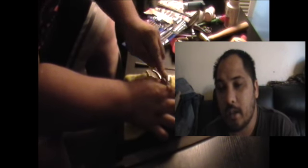During the process it took me a little bit longer than I actually really wanted to, but it all worked out. Using the towel and the vise to help keep the brass and the wood safe from being over-pressured. You'll see me going around through each and every single crevice with a needle file, making sure that everything is all flat and able to seat well on the buttstock.